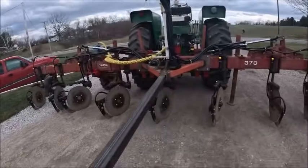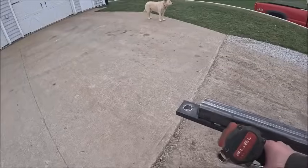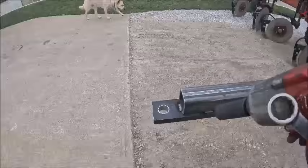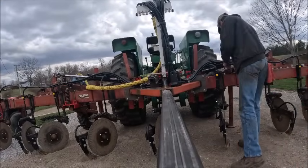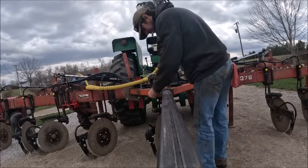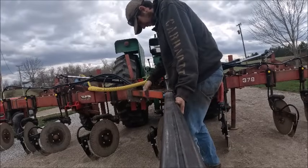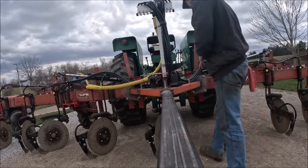All right. I lost you for about 3 hours there, because I got this tack welded on. I put like four 1-inch welds all the way around it, because I didn't want to get too committed until we hook this thing together and try it and make sure that my hole's going to work out and everything's going to work out. Then I went to put it all together and realized we didn't have any of the right length 5/8 bolts. So I figured while I was going to town, I would go ahead and get everything I needed. Naturally, still missed one thing, but it was because nobody had everything I needed.